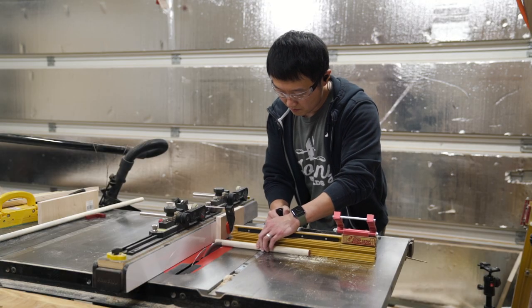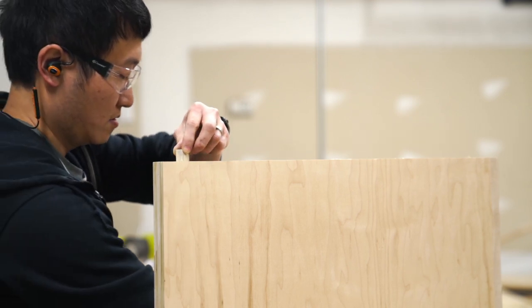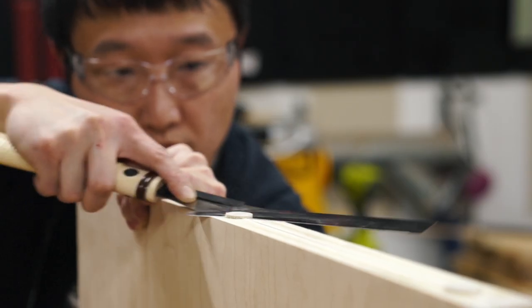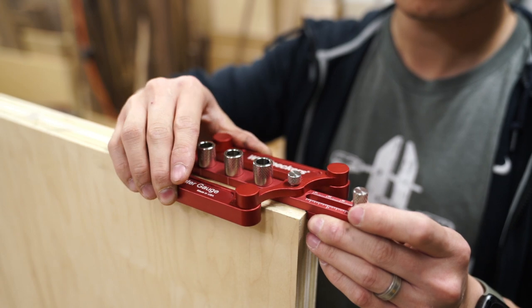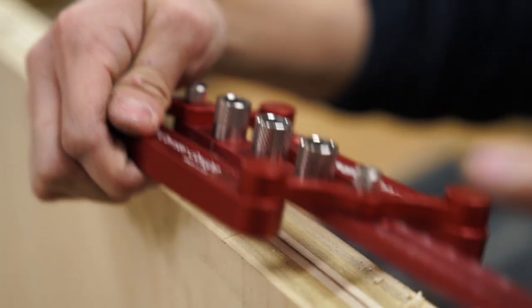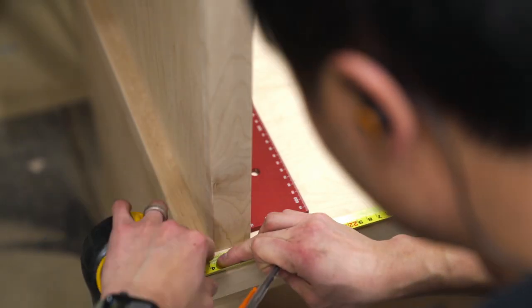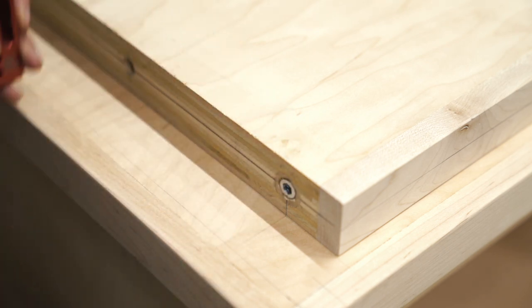What I ended up doing was drilling ¾ inch holes where I'll be putting the threaded inserts, then cutting some dowel plugs to fill those holes, so the threaded inserts are actually embedded into the dowels — a much more robust way to hold the inserts. I've been using a centering jig from Woodpecker, which made it really easy to keep the threaded inserts lined up down the middle of the part and perfectly normal to the surface. If you don't have this jig, it's totally fine — if things are off a little, you can oversize the through holes in the bench top to account for that deviation. Since my inserts were centered, all I had to do was transfer the center line of the wall panel to the bench surface, then lay the panel down on its side to finalize the position of the through holes before drilling them.